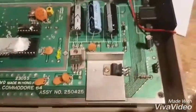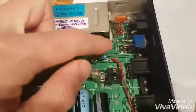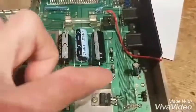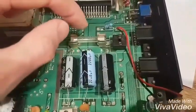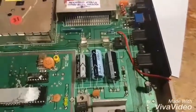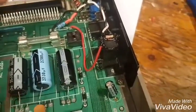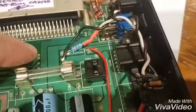So on this particular C64, don't need to cut any tracks. All I've done is lift that little inductor — voltage in, voltage out will be back to the other side of the inductor. I'm probably going to mount it about here, not right there because the drone tape is so sticky it could ruin the board. And then the ground — I think it's somewhere up here. I'll link Ray's pages because he's got all the information on there. So there we are, that's all in, just mounted here, not going to go anywhere. Power in, power out and ground.